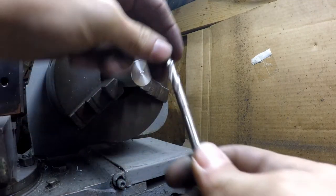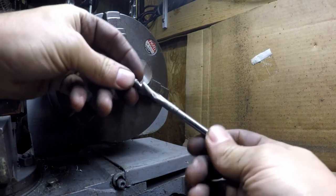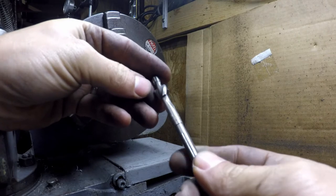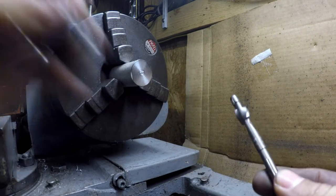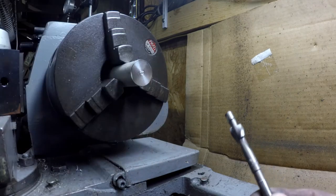Today's two-minute tip is actually a how-to. We're going to show you how to use a counterbore bit if you've never used these before. What it will do is make it so you can get it flush — so if you need to put a cap screw in the hole or something, it won't be sticking out.